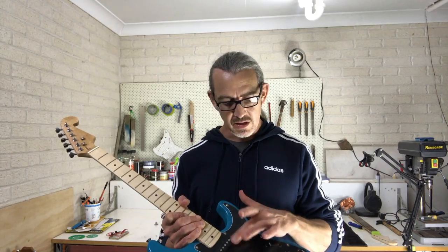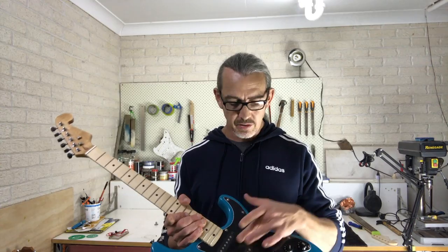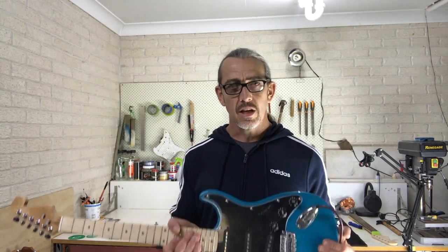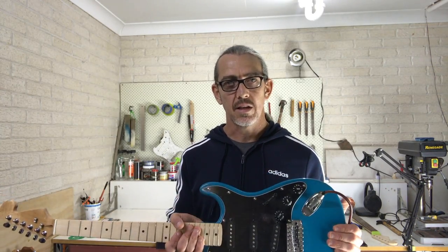It's less of a problem with guitars with humbuckers — the way they're wired, a lot of that interference is sent directly to ground. But in the case of guitars with single-coil or P90 style pickups, they can be noisier, and that's the reason — it's EMI or electromagnetic interference. The way to combat that is to shield the pickup cavity and also shield the underside of the pickguard. This is a relatively simple job, really doesn't take any experience or special skills — you just need a good sharp pair of scissors and some copper shielding tape, which you can buy off eBay fairly inexpensively.